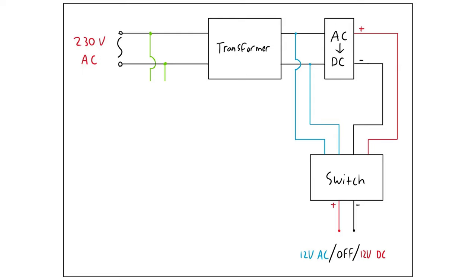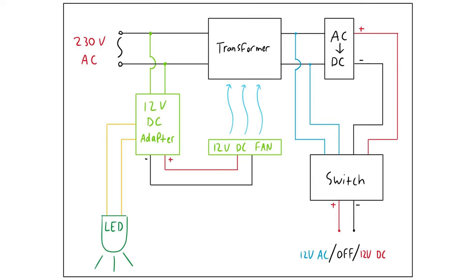Now, this is basically the whole circuit, but I wanted to add a fan. Transformers can get a little bit toasty, especially when you're basically short-cutting the circuit. The fan hopefully helps to cool the transformer. I didn't want to put the fan on the same output as the etching output, so I added another adapter to the mains voltage. This runs into a 12V DC fan which will cool the transformer. This adapter happened to have an LED light — I could use that as an indicator light for when the machine was running.